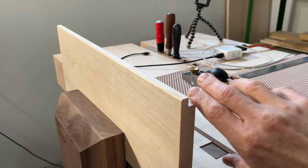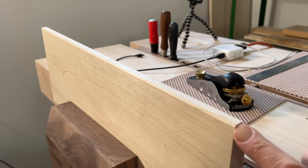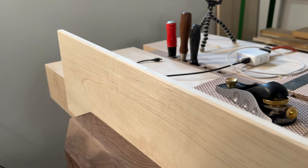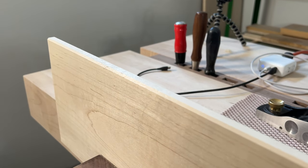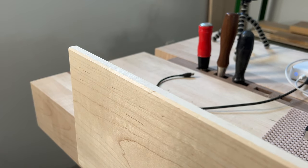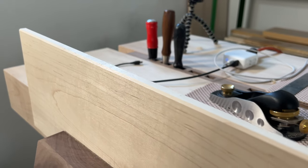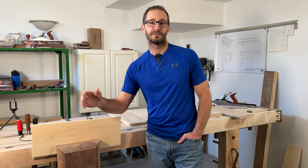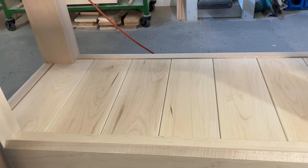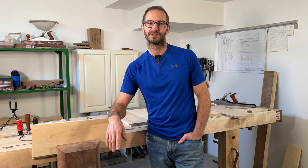Here's the end result: we've got that 45 degree chamfer all the way from one end to the other. It's a little tough to get on camera in great focus, but with a little bit of practice, refining how you're holding your block plane, and using a supporting finger as a fence, you'll get a nice 45 degree angle all the way down. You can make these chamfers as wide as you want depending on the application or look you're going for. If you've never tried this before, give it a shot — it is super easy, lots of fun, and it's going to put a smile on your face anytime you start using hand tools. Until next time, go build something beautiful.